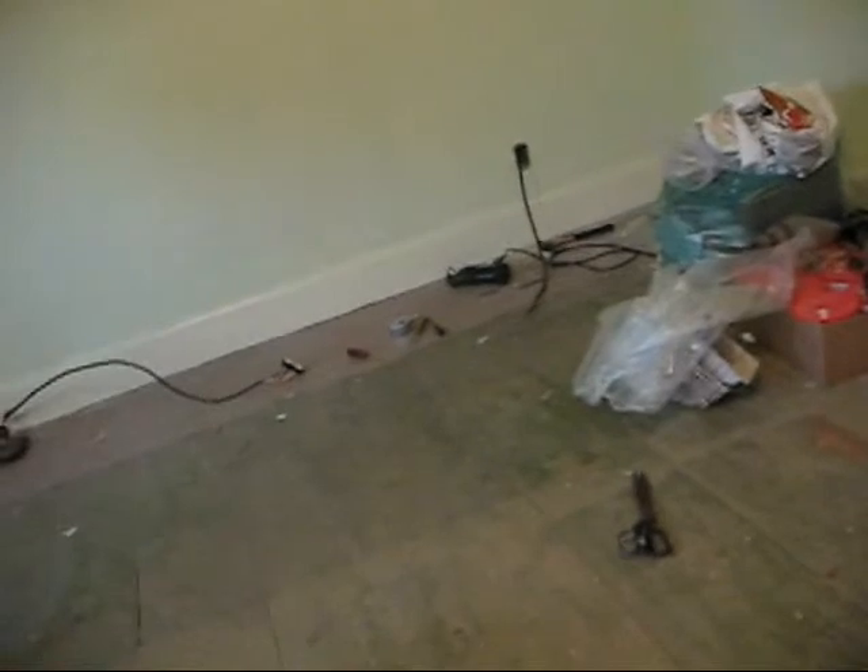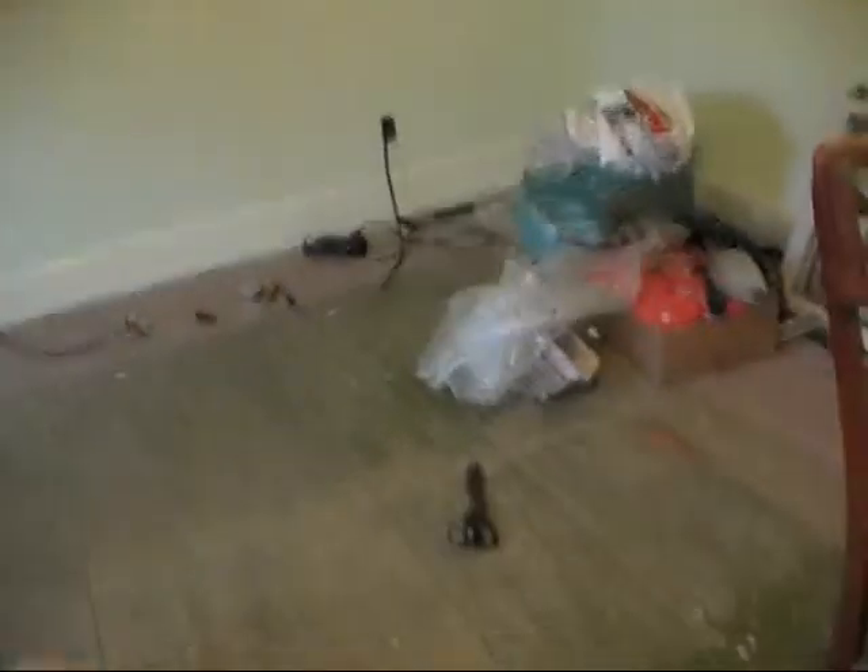That's the hole where my box is going to be mounted, and I went ahead and stuck a piece of wire through there so I can go on the back side, find it, and feed another piece of wire back in. If this was a regular sheetrock wall you couldn't do what I just did. All I did was drill a hole, stick the box in, and I'm going to shoot some screws into it — this wall has laths behind it with plaster over the laths. A sheetrock wall would have studs and you'd need to find a stud to support the box, though they do make boxes you can put on sheetrock without hitting a stud. I just want to say that so somebody wouldn't punch a hole in sheetrock and think you can hang a box right onto it — unless you've got the right kind of box, that wouldn't work.